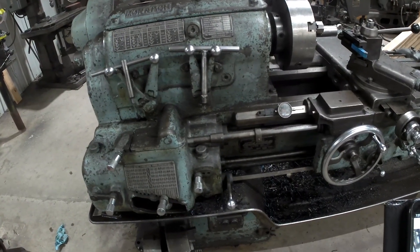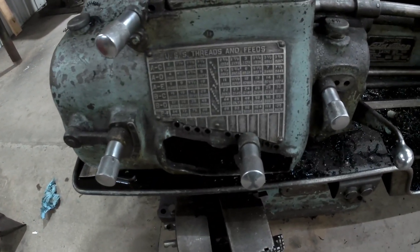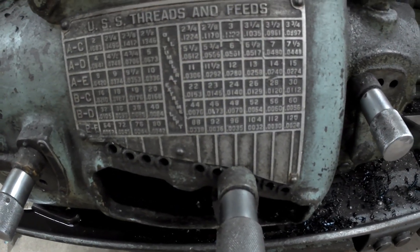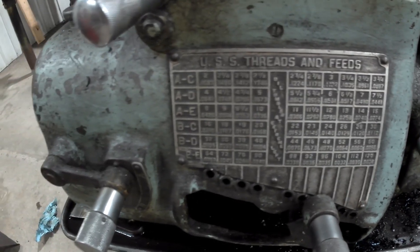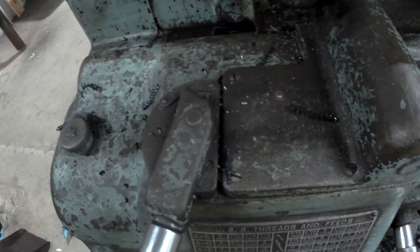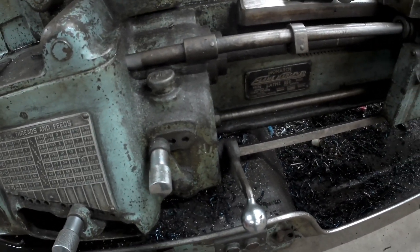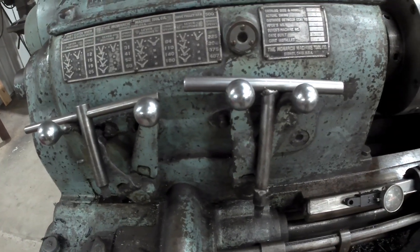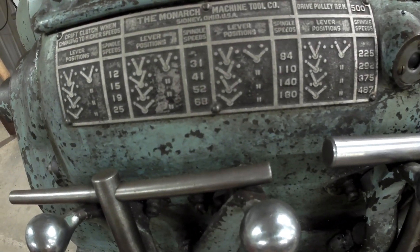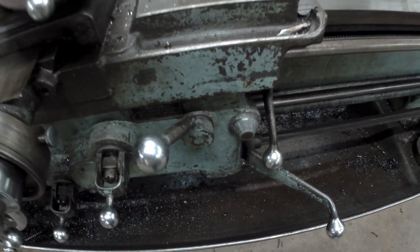I just want to go through how we're going to set all this up and run it. I'm going with a 6-pitch to start with because we're using 2-inch material. By our thread chart here, that would be A-D with the lever in that position — we're at A here and D up top. This lever is what engages either our lead screw or our feed shaft. We're going to run at about 68 RPM on the spindle. It's a 2-inch shaft so we'll keep it slow.